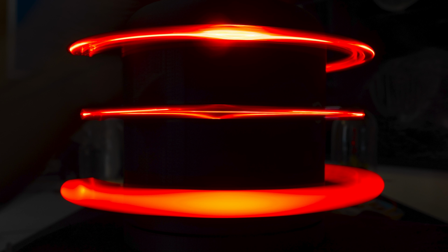And open, rotating. Oh, that's so good. Yeah, nice. All right. Now, we're not going to really know till we see the back of the screen, but what I imagine is happening, in theory, is the bottom one is a 10mm diffuse LED, so it's going to give us a more solid shape all the way through. And the middle one and the top one, as they travel past the lens, we're going to get quite a different texture and shape. I'll go again.